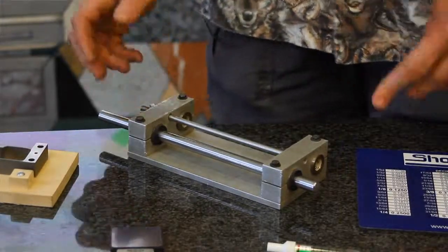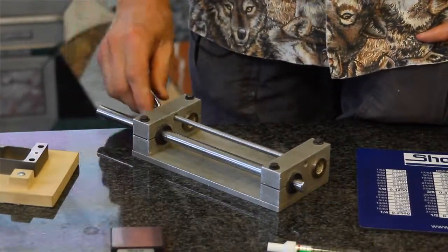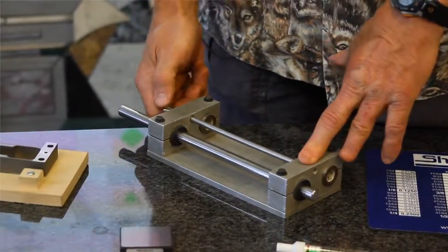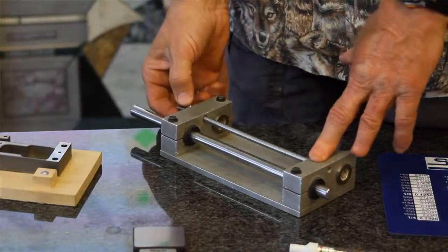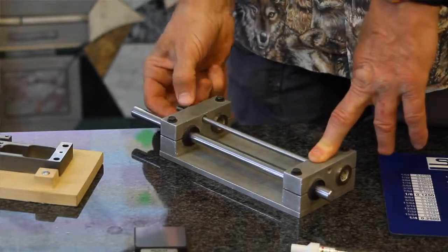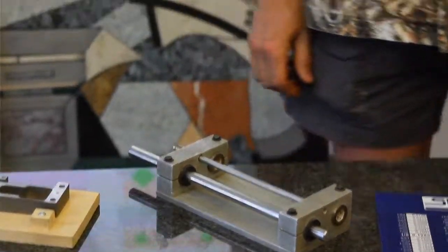So often in the context of just assembling a machine and bolting all the parts together, you can cause enough misalignment to cause the bearings to become overloaded. And that can be the key difference in performance and indeed lifetime between a high quality machine and a machine that's just low cost. It looks like it's the same machine, but it's actually a very different machine. One may last for years and years, and the other may only last a fraction of a year.